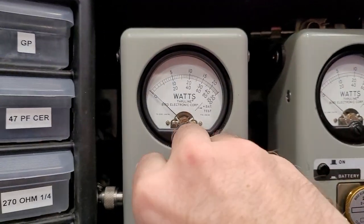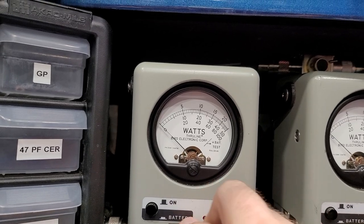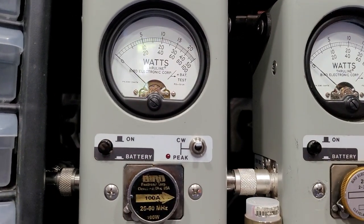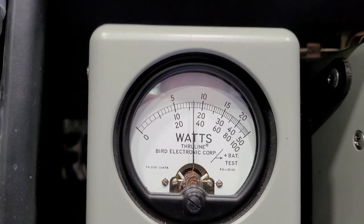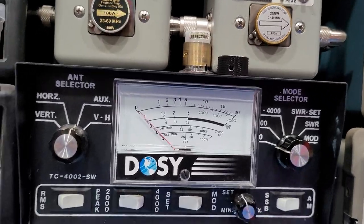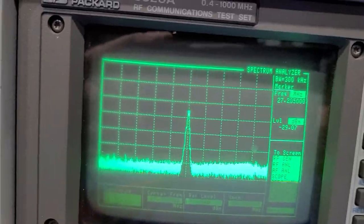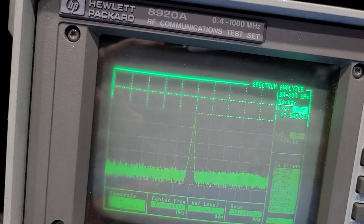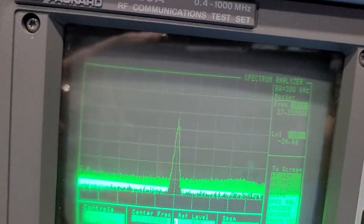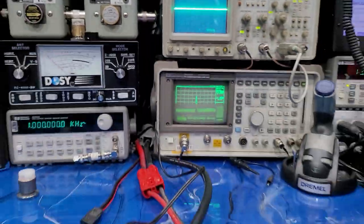Yeah, it still overtakes the 25-watt slug, so we'll put a 100-watt in here and see what we got average there. 100-watt slug, bottom scale. It's like we're still going to do about 32 bird, even if you key at 2 watts. So you're definitely going to have to bypass the 1-pill stage in your 1x2. Lower carrier modulated, looks good. I raise the carrier all the way up, modulate again, still looks good on the spectrum analyzer. So everything is like it should be there.